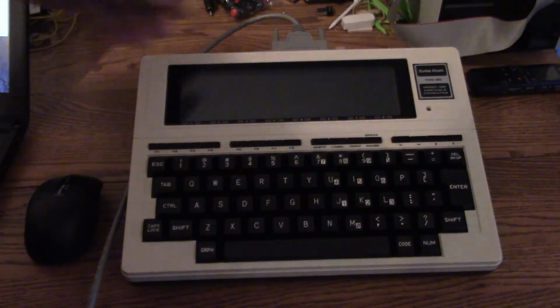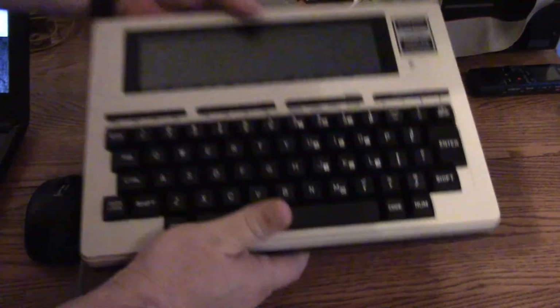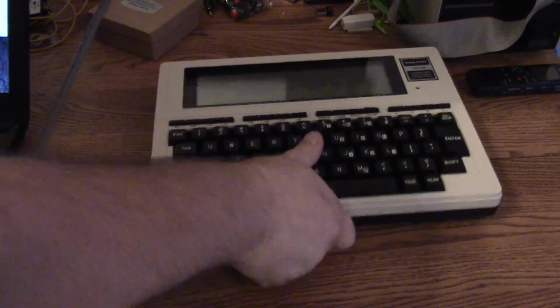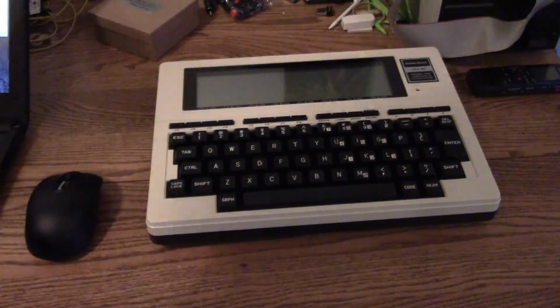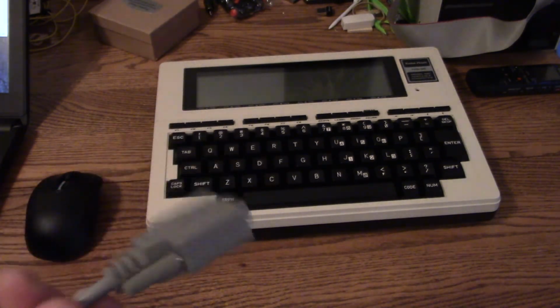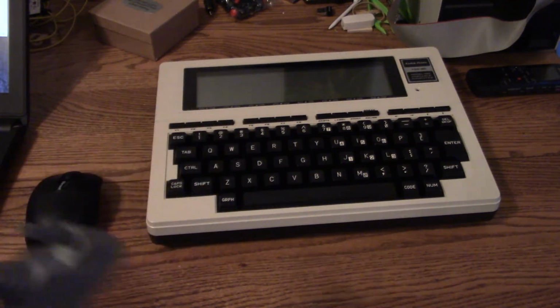Okay, so here's the cables we're using. As you can see, just gonna go ahead and take that off, and always turn it off before you start hooking and unhooking cables. But you can see it connects onto the back. It is a large RS-232C type connector, so it's got the large plug on this side. I got a small serial port connector on this side. This is how it came from the company I ordered it from on Amazon. Unlike the traditional ones, it does not say Null connector on it, it's just generic.